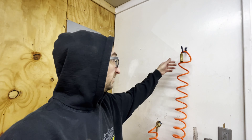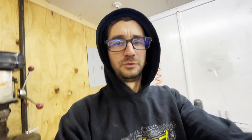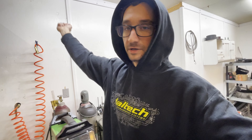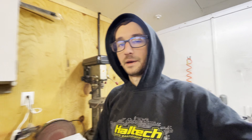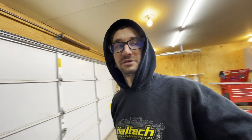One thing I did need to do in this garage was plumb it for airlines. I went ahead and plumbed an airline fitting right here for the fabrication area when I need to use my grinders and stuff. I want to extend this up — put a 90 off of it and a T so I can have a quick push-lock hose right there, and also do a drop reel over on this side. I also have a lot of room here so I'd like to put maybe a lathe in over here, just some equipment that would actually help me out.